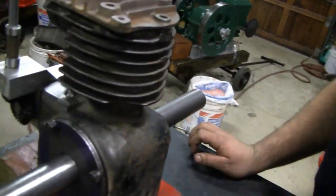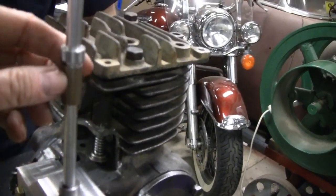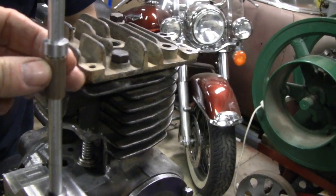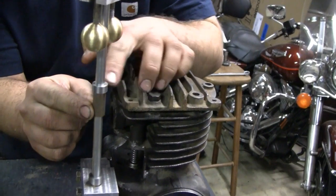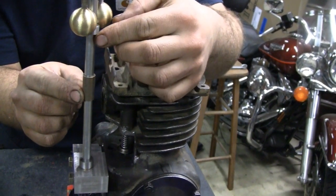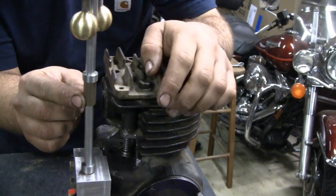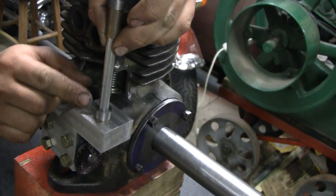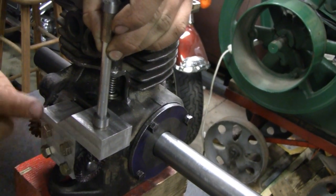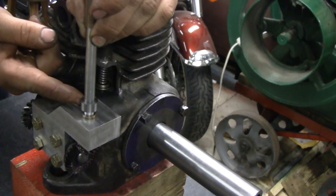What else did we do, Mike? Just got the head on — we have the head sitting on, got a couple of bushings and bearings on here. These bushings will hold this steady; we're going to attach it to the head. This will eventually end up here to adjust the spring tension, and this collar down here will hold the shaft up so the downward force isn't on the gear teeth — it'll be on this bronze bushing.